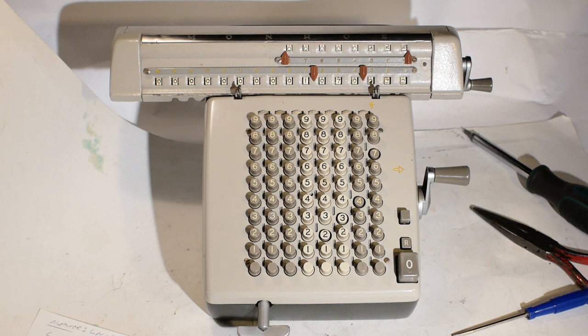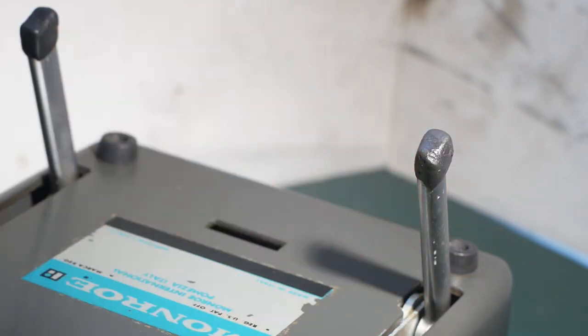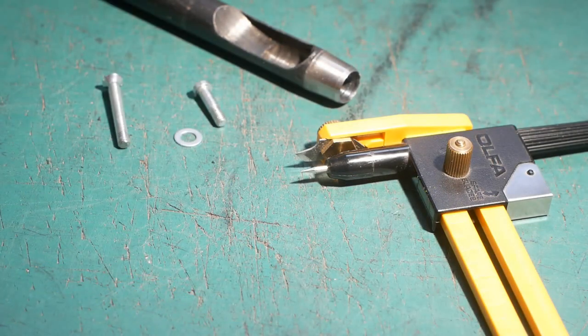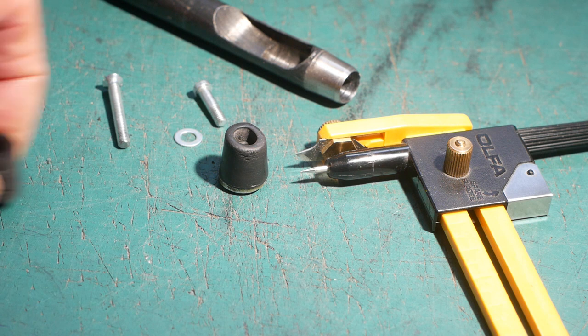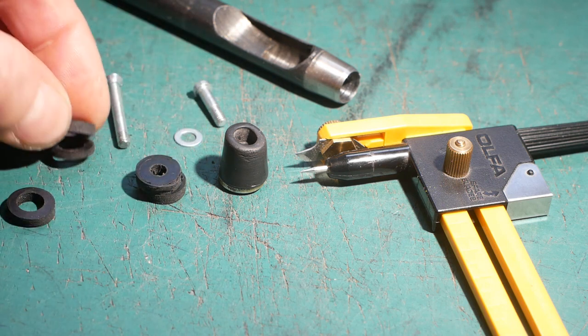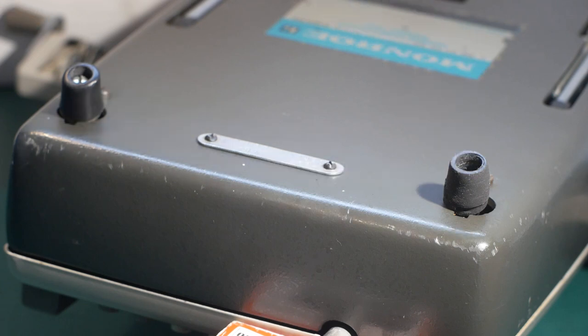I'll demonstrate the machine more thoroughly once I've done the feet because I've still got those to replace. We now have some rear feet — I didn't think I'd be able to find any to buy so I've moulded some using Sugru. I've not used this before but it's a mouldable rubber that cures once you've taken it out of the packet; it takes about 24 hours to cure. For the front feet, here's the original one that was on the machine and this will be the replacement. I've cut some discs of rubber — the bottom two with a small hole for the screw to pass through and the other three with a bigger hole so the head of the screw can sit in them. I'll glue these together and profile them to the same shape as the original and it should be a reasonable facsimile. This is the new foot I've just made next to the original — they look similar enough and it sits quite level, so that's job done.